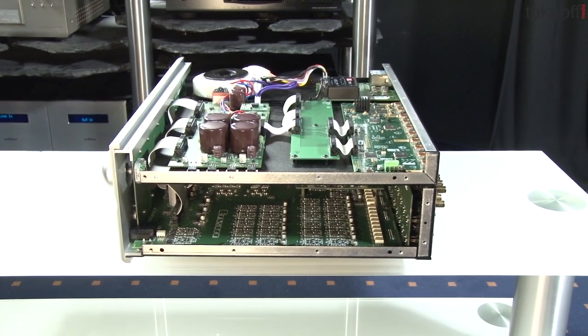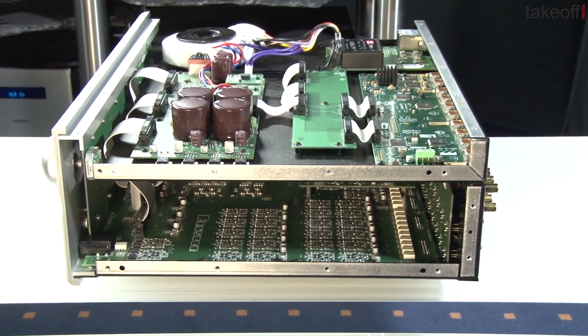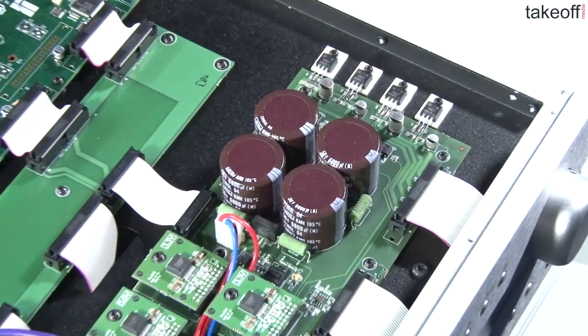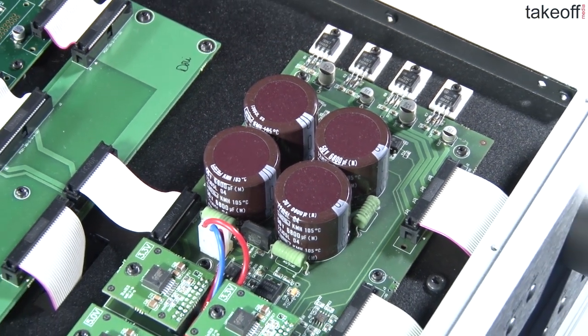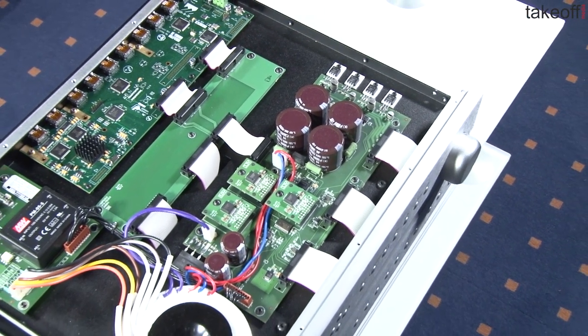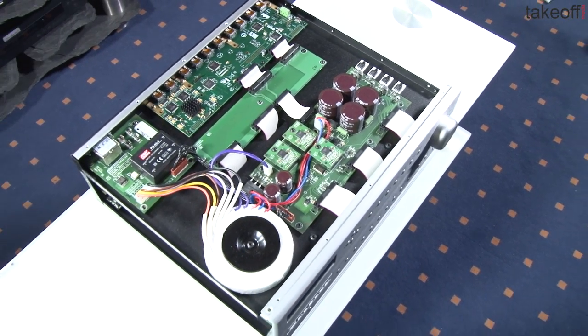The SP3 has three power supplies that provide a digital board, the front panel, and the analog circuit. The analog circuit even includes a discrete analog class A circuit in the analog output driver section, where the voltage gets increased to make sure that the components work well. Like that, Bryston is trying to achieve the maximum possible separation of the components from each other regarding problems like crosstalk or interference.